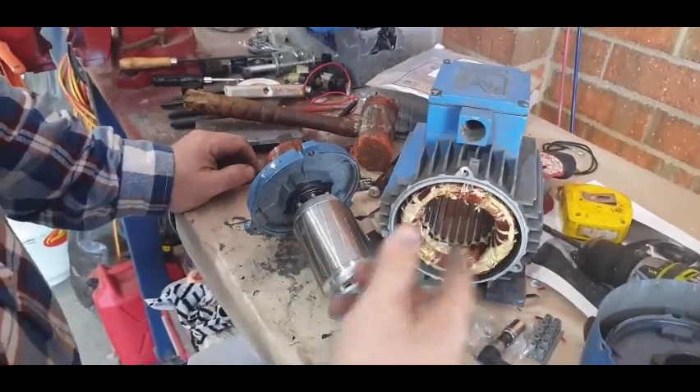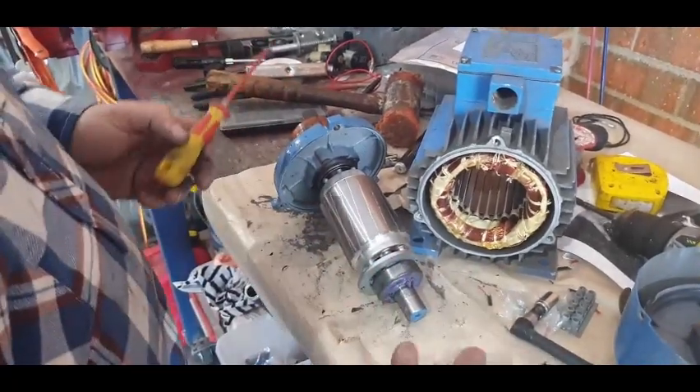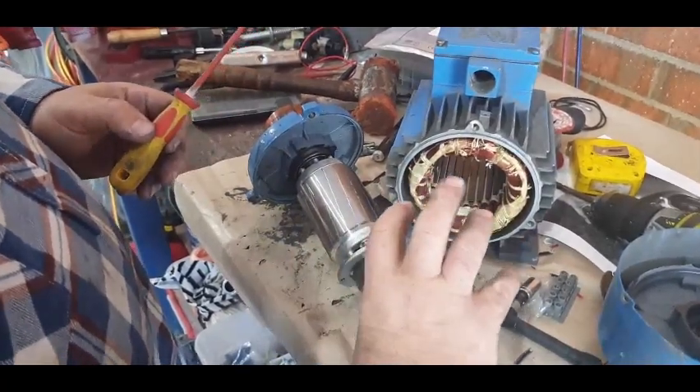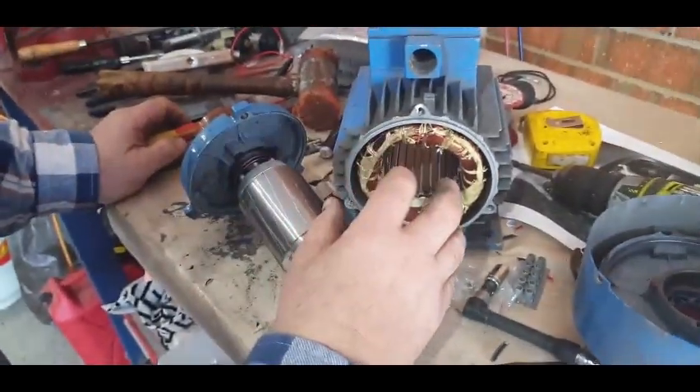Turning this and making it turn, we get the shaft. We call this a squirrel cage motor — three phase — because we don't have to have a starting switch. We don't have to create a phase difference like in a single-phase motor. In a single-phase motor you have one phase and it's not rotating, so we create a phase difference using two different size windings.